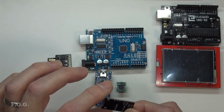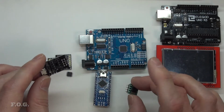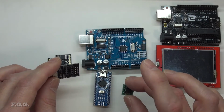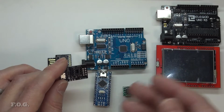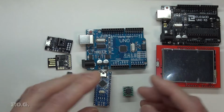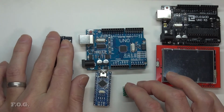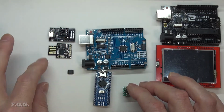Yeah, after figuring it out and programming a bootloader in it and then trying it out and understanding what's going on, especially when you program it, you take it out, you put it into your application, and you have to wait for it to fiddle around while it gets over its bootloading session, possibly putting junk on the buses while doing that. This was just not that interesting to me. Well, it's a good experiment, and I know how it works.